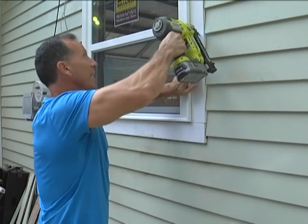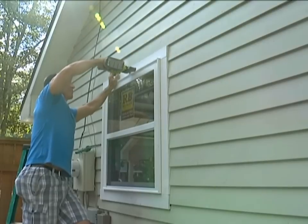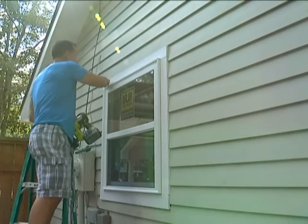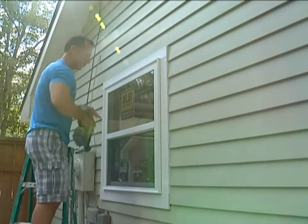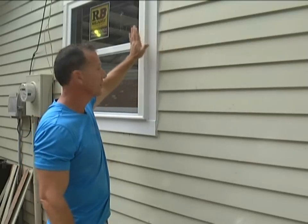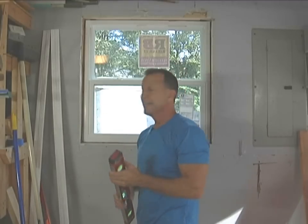Nice fit all the way around. I'm going to take and run a little bead of caulk all around my channel here and on the outside because I'm going to paint this and I want it sealed up really well. It's all completed out here and everything's sealed up. Now all I have to do is come back and paint it, which I was planning on doing anyway because I started painting the house and hadn't addressed this side — I was waiting to get this window in. On my next video, I'm going to show you how to put the trim on here and case this in. That's real simple too, a lot easier than doing this, and it really dresses it up.